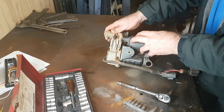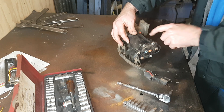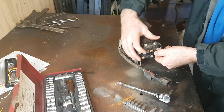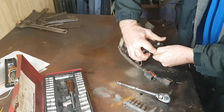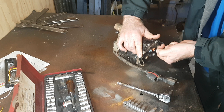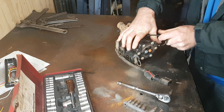The desiccant is stored in this unit, so you've got your line that comes in from the compressor in here. These are quite easy — just put a bit of pressure in, hold these down and pull out. If you just try and pull them straight out they don't come, so just hold that little tab in and they come out quite easily.